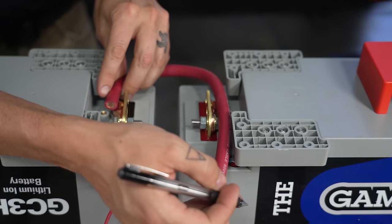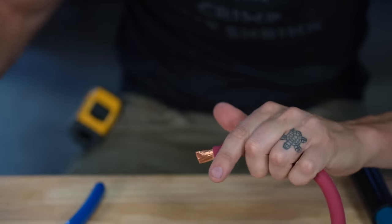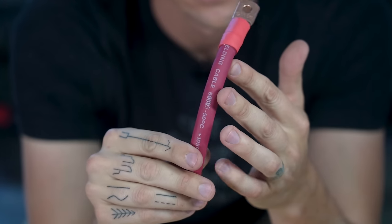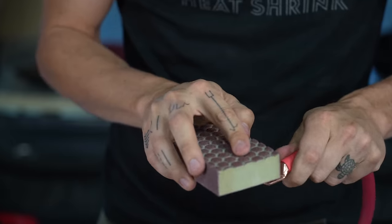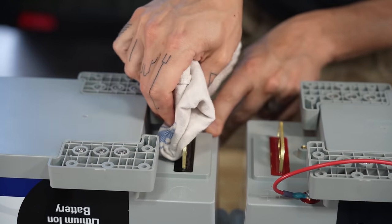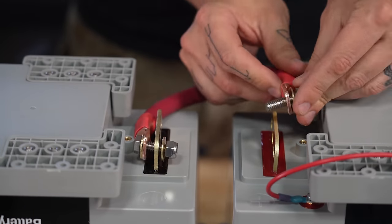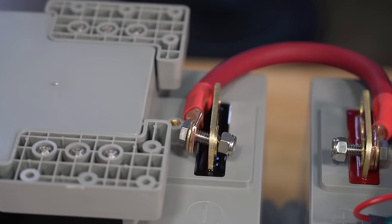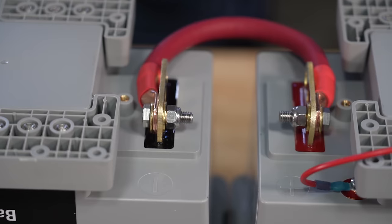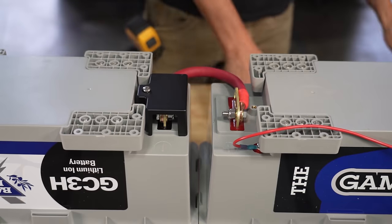Now it was time to make the battery interconnect wire to turn these two 12-volt Battleborn batteries into a 24-volt bank. I cut, stripped, crimped, and heat-shrinked a 1-aught by 5/16-inch wire lug onto each end of a short piece of wire, and put 3/4-inch heat shrink on each end. I sanded and cleaned the lugs and cleaned the battery terminals with alcohol to remove any manufacturing oil, dirt, or grime. I bolted the lugs directly to the battery terminals with the included hardware — it's crucial that nothing like heat shrink or washers is between the lugs and terminals. Tightened to spec with a half-inch wrench and socket. The battery terminal connection should show lugs in direct contact with the terminal, washers on each side. Then replace the battery terminal covers.